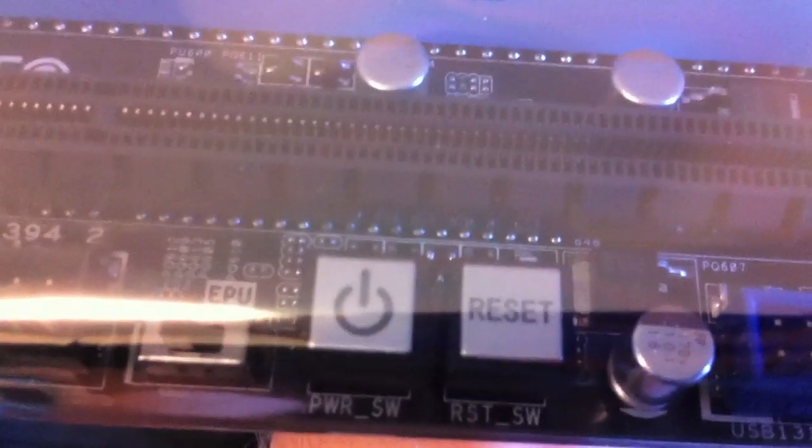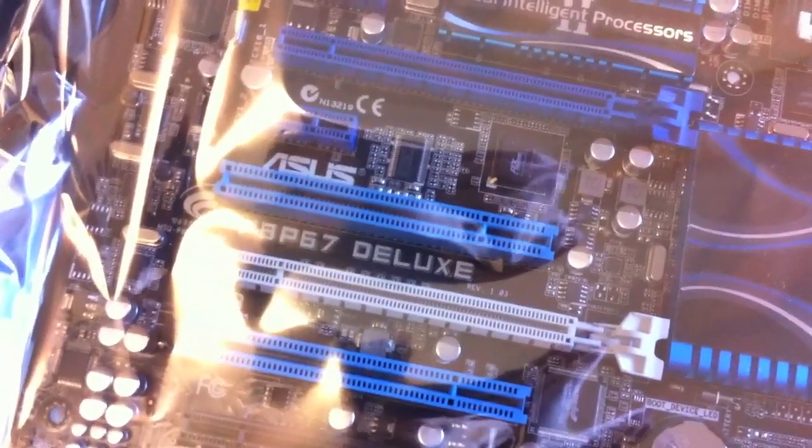And two ethernet jacks here for dual gigabit interface. So let's pick this up and get another look at those beautiful fins — I really like the way ASUS has done this. They put their sweet time into this. There are eight SATA ports, your standard 24-pin connector and eight-pin additional power, your front IO connections, and a nice power and reset button right on the motherboard. There's an EPU switch for energy saving, a port for the USB 3.0 box, and three PCI slots. Two of them run together at X8, the top one is X16, the middle one is also X16, and the bottom one runs individually on its own.